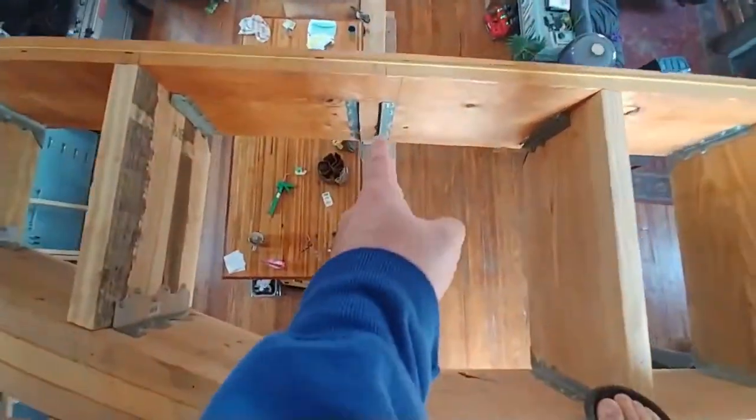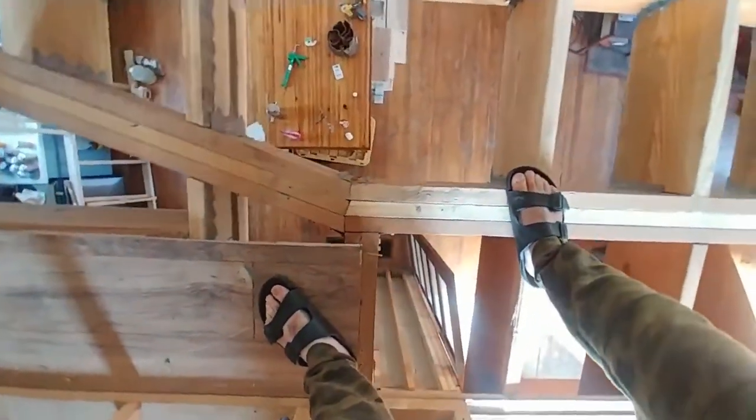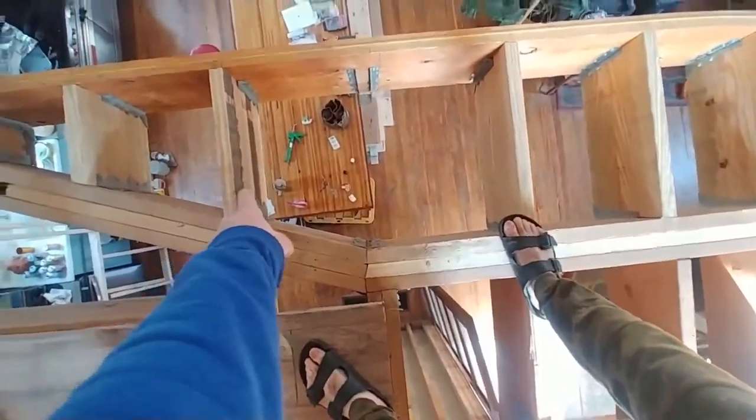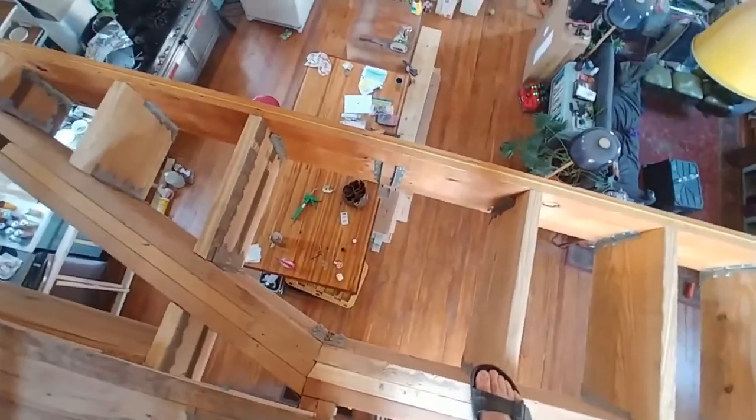Now over here, because of the layout and everything else, this joist ends up, the hanger needed to be right on top of that hardware. So I haven't figured out a solution for that just yet. Just keep heading things off and heading things off. You can do it. It's just more friggin' around. Basically, I could just jump straight across from the first opportunity to put a joist hanger on here, right through there, and that would bisect, making these extraordinarily long, but unnaturally narrow.